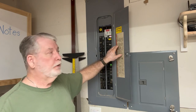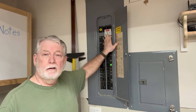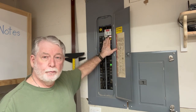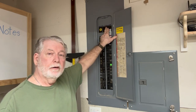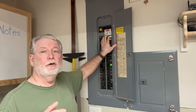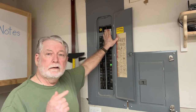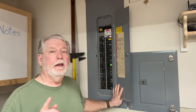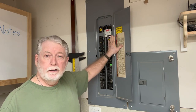When you have a whole house generator, you have to be very careful and have an interlock system like this, because you do not want to accidentally turn on this breaker and still have your power on. You want to make sure that this main house breaker is turned off first before you turn on the generator breaker. That's critical because if you're running a generator and you accidentally leave the main breaker on, you're actually back-feeding the electrical lines. And if you have a lineman working on the line, he could get electrocuted — and that would be a really bad day. So having an interlock is something that you really need to have.